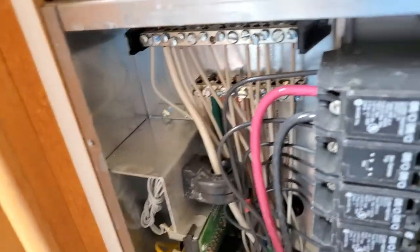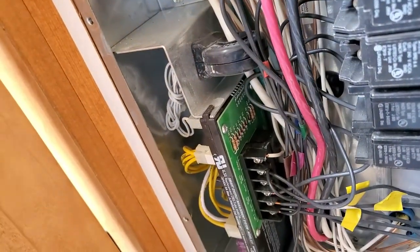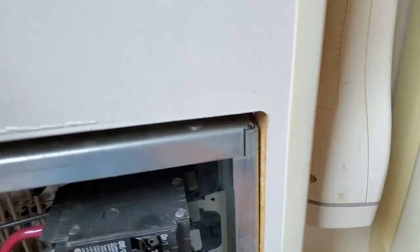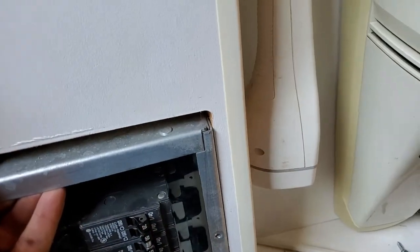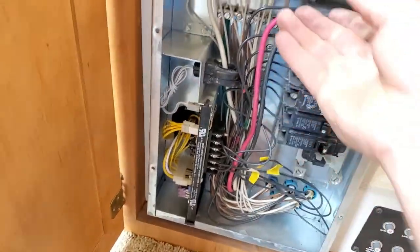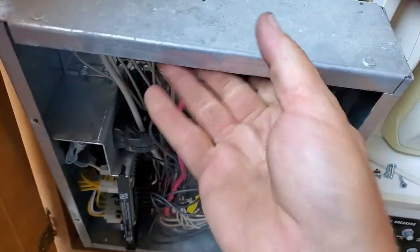So I'm going to take the cover off. I'm going to turn the generator off now, and then work with those 4 wires. In my case, I removed the screws on the side. There's another one over there, and there, over there, and over there. Removing these so that this breaker panel can come out. Obviously make sure that everything's unplugged at this stage, right? You want no shockies.